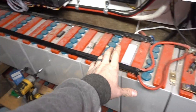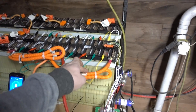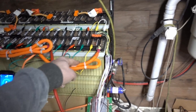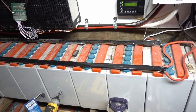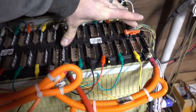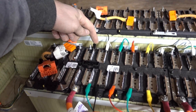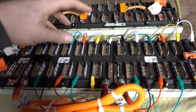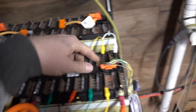These batteries feed into these batteries, which would be fine eventually because these can sit at a max of 50.4 volts, and it's not gonna be much higher than that where these ones like to sit either. These ones can't be charged more than that though. The BMS is hooked up to this group of cells here, and I jumpered with little alligator leads to all the other cells, so all these cells are being monitored through just the one jumper.